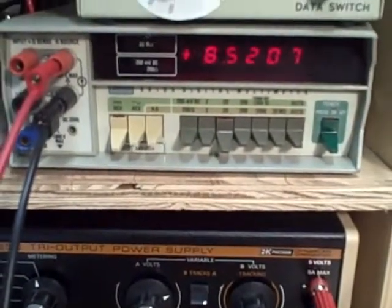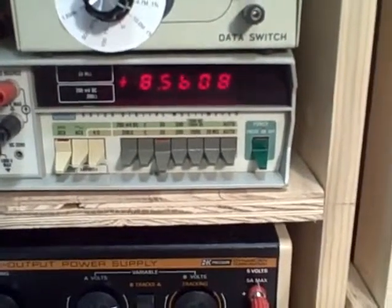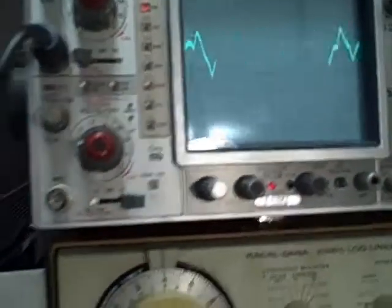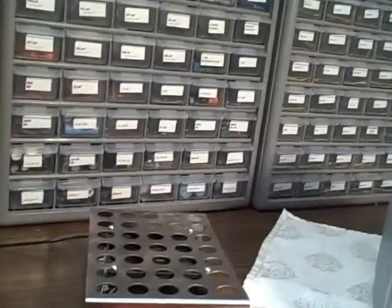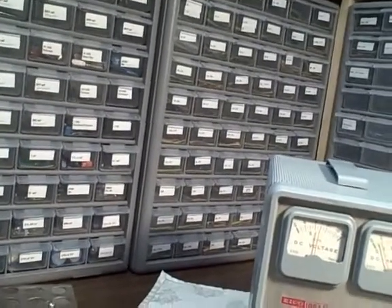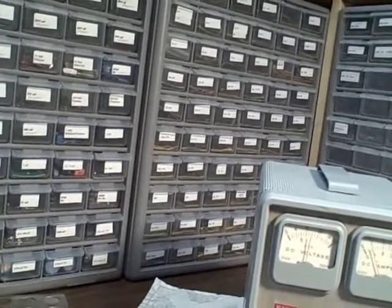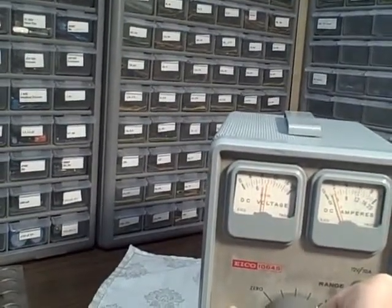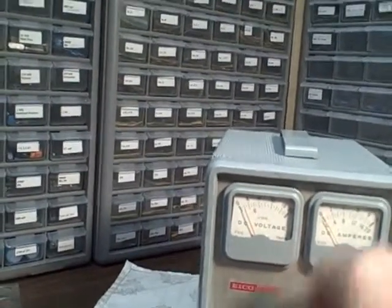Let's take a look at the 6-volt scale. On the 6-volt scale at maximum, that's 8.5 volts and 8.5 amps. We are reading a little over 100 millivolts, and it's kind of spiky looking. On the 6-volt range, we're supposed to be 4 to 5% ripple. We're pulling 8.5 amps, and 1% would be 0.08 volts — five times that would be 0.4 volts. We are running about 0.15, so we're well under that. Ripple is low on the 6-volt scale also.